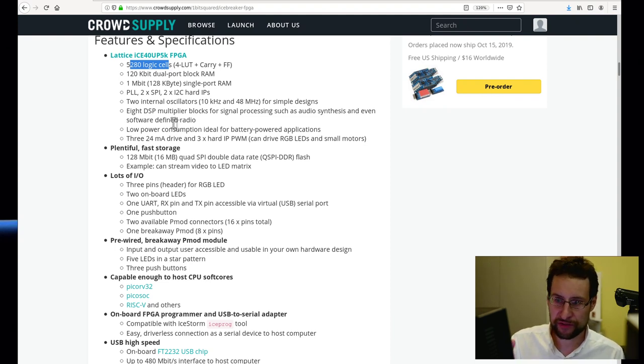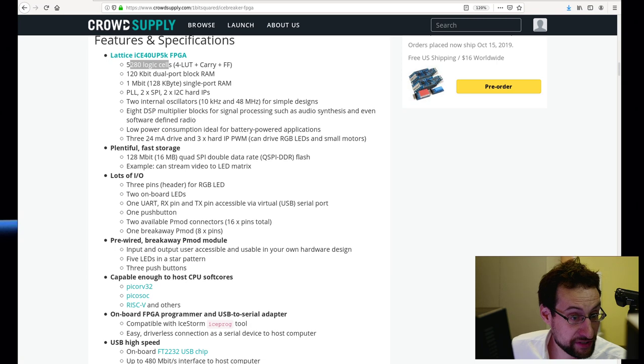You have a high-performance, fixed-function multiplier block, so if you implement a 32-bit multiplier otherwise you'd certainly use quite a lot of logic cells. The iCE40 is one of the default example targets for PicoSoC. PicoSoC is Clifford's PicoRV32 plus some integrated system-on-chip peripherals. People wanting a RISC-V board should know an FPGA is more flexible — you can even run Linux on a RISC-V soft core on an ECP5 dev board.